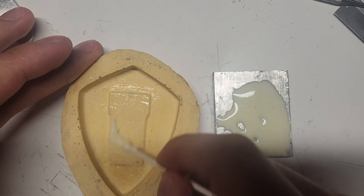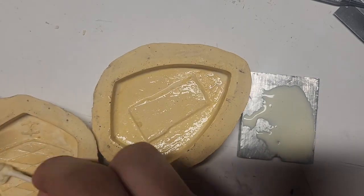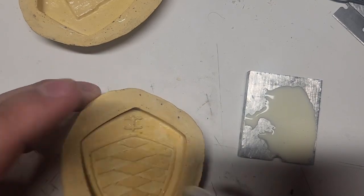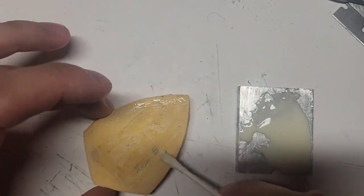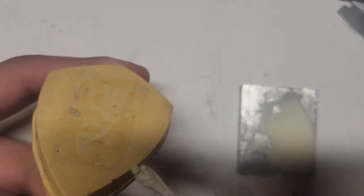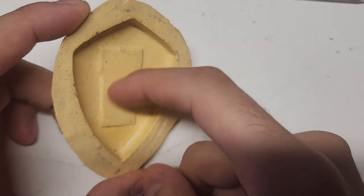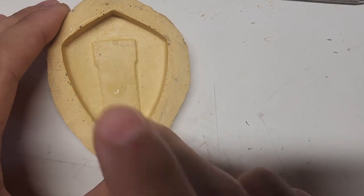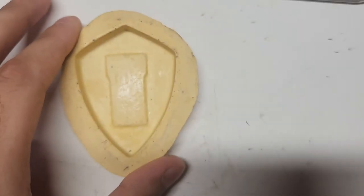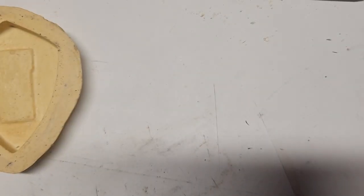Now that the molds are smoothed out, I prepared the surface so that I can layer it with carbon fiber. I experimented with a few different materials, but it seems that a PVA based solution might work the best. Although PVA is not recommended for use with high temperature, it still seemed to withstand the curing process. Wood glue is PVA based, and I had some, so I just mixed up some water to thin it out and applied it over the entire surface of the gypsum. Any excess water is absorbed into the mold, so that's not an issue once the epoxy starts to set. After drying, the surface is noticeably shiny and has formed a strong layer, so I then sprayed 3 layers of the epoxy mold release and let it dry. One thing to note is that I excessively smoothed out the mold to the point where there was some distortion on the surface — this didn't need to happen, and if my printer was properly calibrated, perhaps the surface wouldn't need any sort of repair.